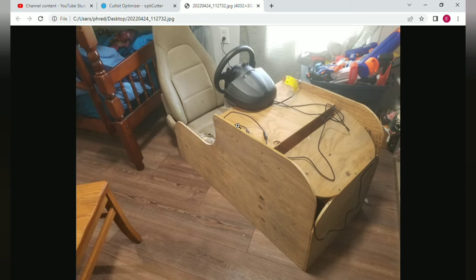And then I also needed a 20 inches under here, I thought, to stabilize this so this didn't bow on me. I put 20 inches under there, and you would still have 25 inches left of stud on your second stud, even after running 1, 2, 3 across here, and this one. This is not figuring for a missing blade width, so like 24 inches and some change left when you're done, so you could run another one across somewhere else if you had to. So, one sheet of plywood, or anything, 4x8, plus two studs, does get you this.